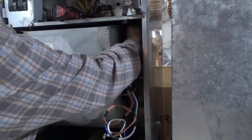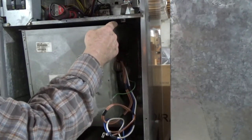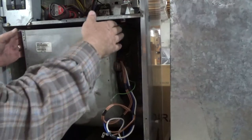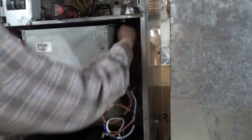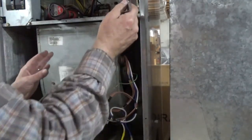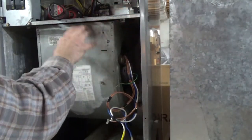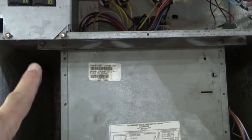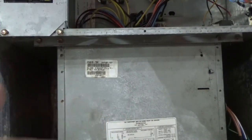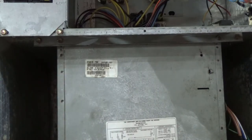We're back to install — slide in and four screws. There are slats, and the edge of the fan housing slides in there. You don't have to engage them right at the very beginning — they're about halfway down, and once you get them engaged it just slides right in. Then we'll put our bracket back on — four screws to mount this plate to the housing. Get all four screws in place. You can put a paper towel between the screw and the nut driver to hold it in place. If you drop it, be sure you have a magnet.